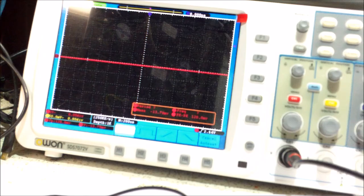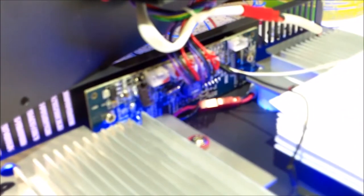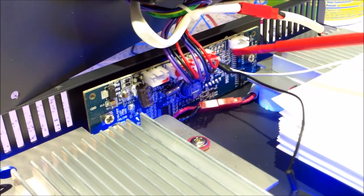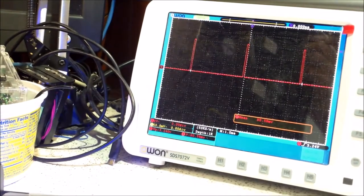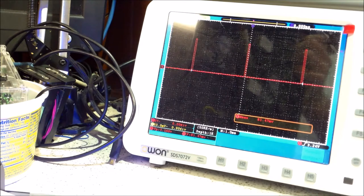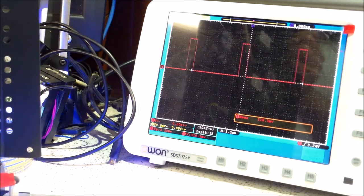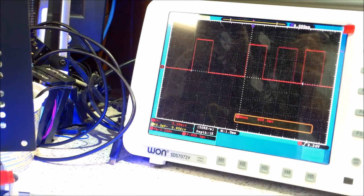One last little note — I went ahead and hooked the system back to factory. I reconnected all the wires and I'm probing the ground, which is the red wire, and the black which is the PWM pin, going to my oscilloscope. I'm going to run through the manual control and show you that on the oscilloscope. Right now we're at two percent — let's move up to 20. There's 20, and we'll go to 50.